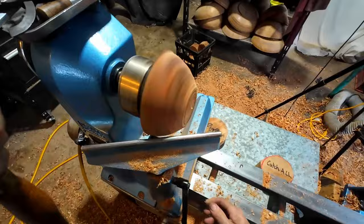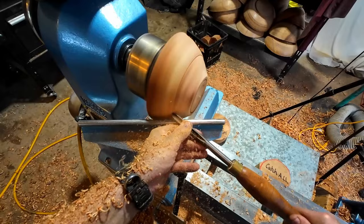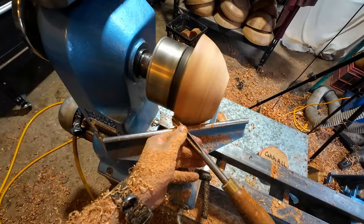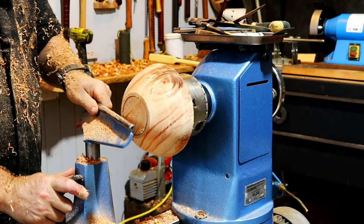That's a little push cut — just to clean it up and to practice whenever you get the opportunity. I'll show you the bottom bowl gouge later too, on this one. So now I'm going to bring that side down, get rid of the majority of the bulk, come over and grab our one-inch skew, make sure we're riding on centre, and drive that skew into the line.